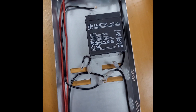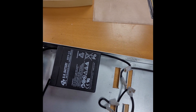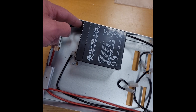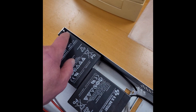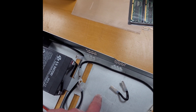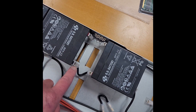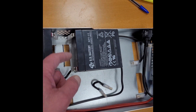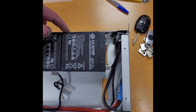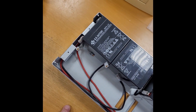Starting with the right-hand side bank: I have a minus here which ends up here, and a plus here which ends up at the connector. So this is plus here and this is minus here. The minus from the first battery connects to the plus from the second battery, and the minus from the second battery connects to the plus from the third battery — for that we use the small cables. The minus from the last battery connects to the circuit breaker. Now let's finish the second row of four batteries.